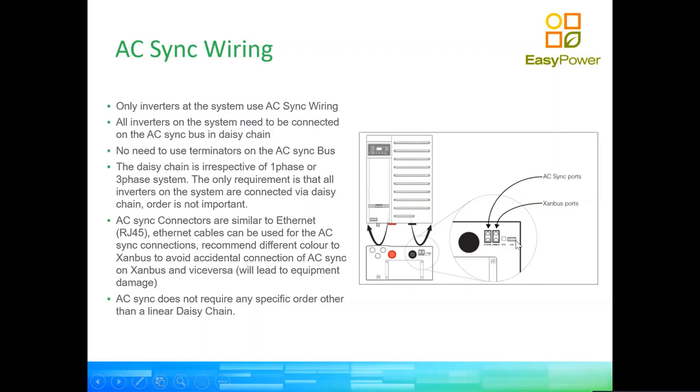This is a 5-pin connector, which we use for a number of applications. Let me briefly describe them. Application one is just a dry contact. So we use two of those 5 pins to open and close relays to do a number of things: switch on lights, open and close relays, send a message to an HMI, etc. We have 5 pins because in one of the applications of the system, which I will explain later, we need to control a contactor to isolate the grid on the larger commercial systems, and that contactor will require those 5 pins.